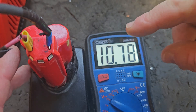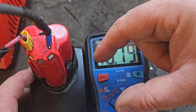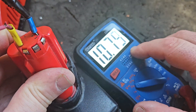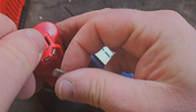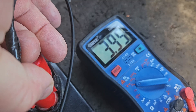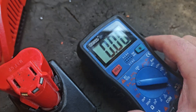There are actually three banks of cells in this — two cells together basically, three banks in parallel, connected in series to each other. The first bank of cells is reading 3.42, and the second bank of cells — checking these two connectors here — is reading 3.96. The third bank of cells can be read with these two connectors and we get 3.26.